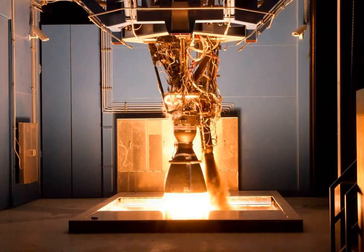A new feature for the engine is the ability to throttle from 100% to 70%. Later refinements of the Merlin 1D have been operated down to 40% of full thrust. Design goals for the new engine included increased reliability, increased fatigue life, increased chamber and nozzle thermal margins, improved performance with a thrust design objective of 140,000 lbf and 70–100% throttle capability, improved manufacturability, lower parts count, and fewer labor hours. When engine testing was completed in June 2012, SpaceX stated the engine had completed a full mission duration test firing of 185 seconds delivering 650 kN of thrust, confirming the expected thrust-to-weight ratio exceeded 150.